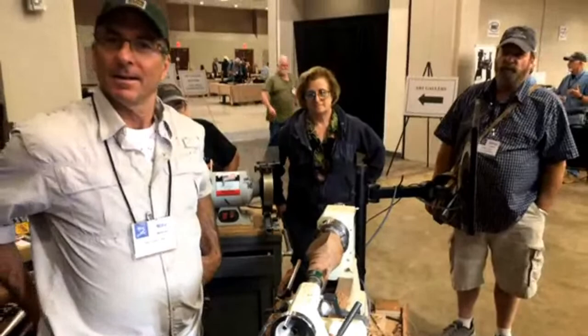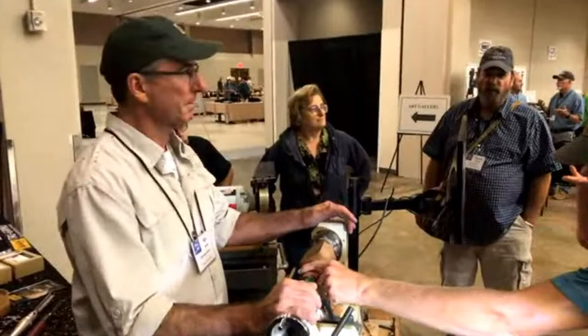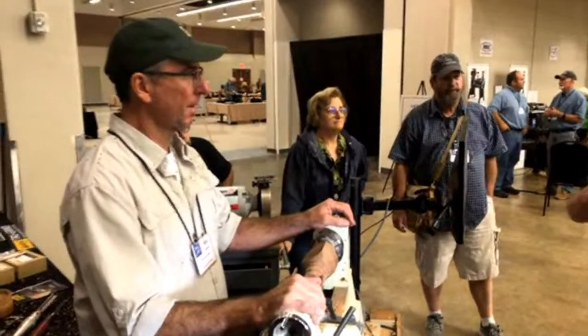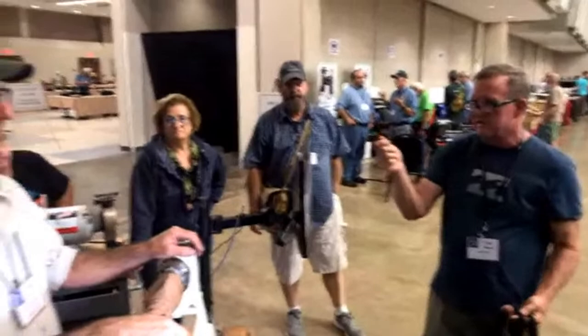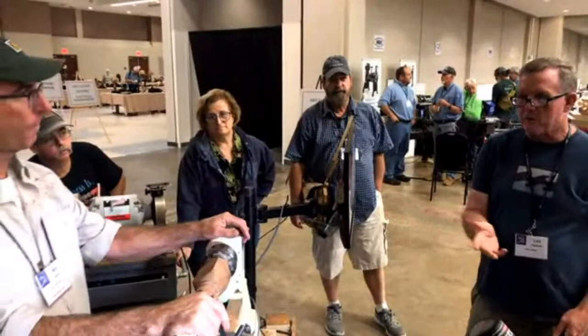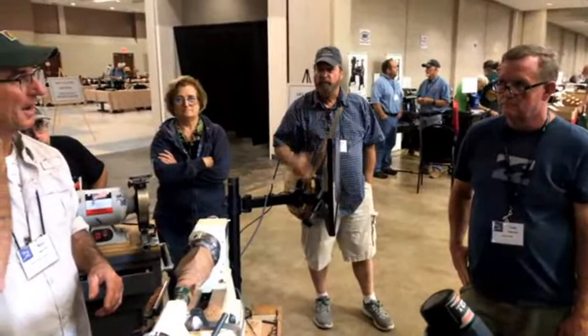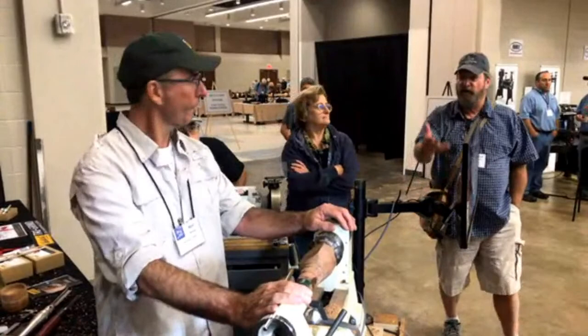That's it for threading. So Mike, perfect. Any questions? If you want to find the right speed for a larger piece, say 2.25 inches, you can take the circumference of, say, 5 inches around, do the math, and increase the speed proportionally. That would do it. You would have the same motion, same piece. But the larger this gets, the more difficult it gets. I've tried to do 5-inch diameter stuff, and it was pretty tough. That's 16 threads, right? Yeah, I was using a much coarser thread then. It was like an 8.